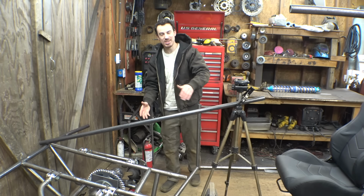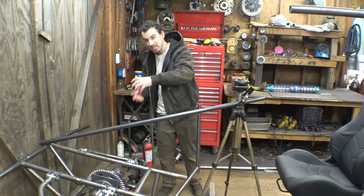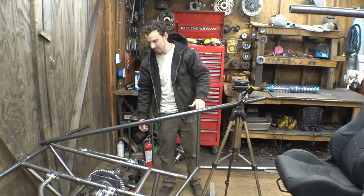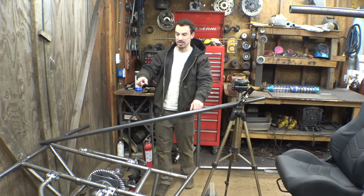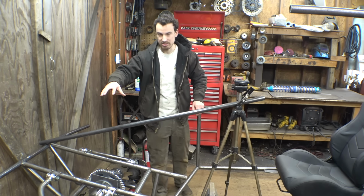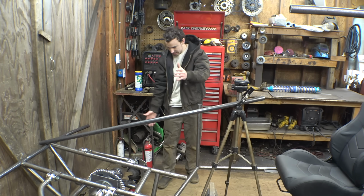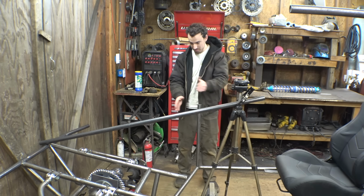So I don't know, we maybe can get a little bit more suspension travel out of this, and maybe if I pull the CV axles a little bit further out, in where they move, maybe I can get a little bit more downward travel. I don't know. So I may play around with this, see if we can get a little bit more. So I'm probably going to buy the shocks with 8 inches of suspension travel, which will make it to where the shocks will be mounted lower, the hood's going to be lower and everything, which is good. Now we still need to put the tires on, make sure they can still steer, make sure mainly that they don't hit this, because I made it pretty close.